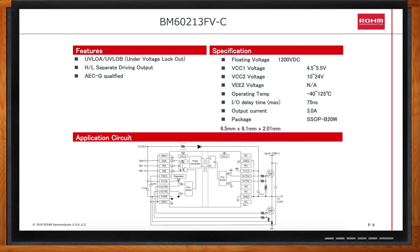The high side supply, VCCA, is typically developed using a charge pump, as shown in the schematic. The BM60212FV includes a Miller clamp MOSFET, which holds the gate of your power device tightly to the source when the MOSFET is supposed to be off, to prevent conduction caused by the MOSFET Miller capacitance during fast voltage drain-to-source transients. Parts include undervoltage lockout for both high and low side, and accept logic inputs of either 3.3 volts or 5 volts. The parts have a separate output pin for source and sink, which allows you to easily adjust the rise and fall times independently.